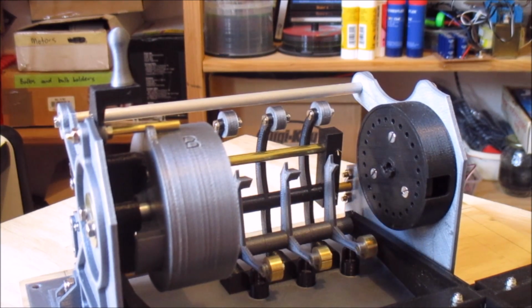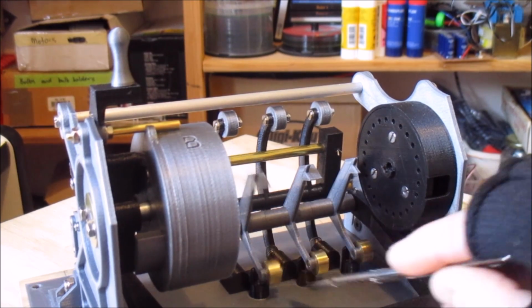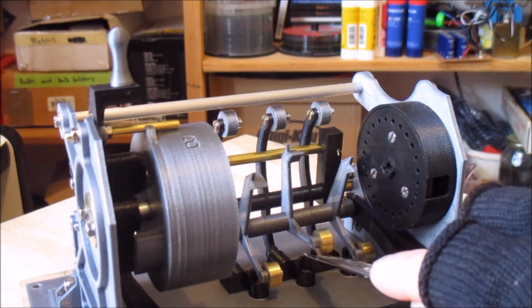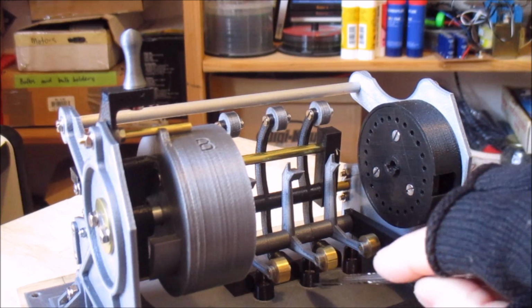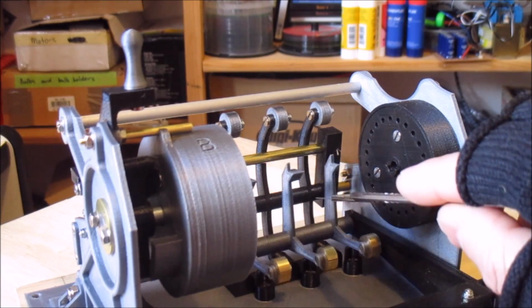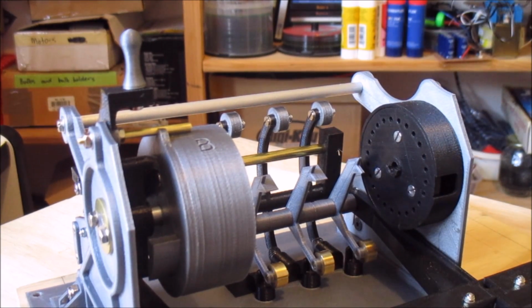You can also see, if I can find something to point with, scalpel, that'll do. Underneath here, so you can see the pawls lift up and down, and under here there's a little piece I call a buffer, and it's just a little stand. And what happens is as the keyboard comes up, the pawls ride on the edge of these little buffers, and that's what's lifting them up and back. So that's what lifts them all the way up out of the way. These are just printed parts bolted into the base.